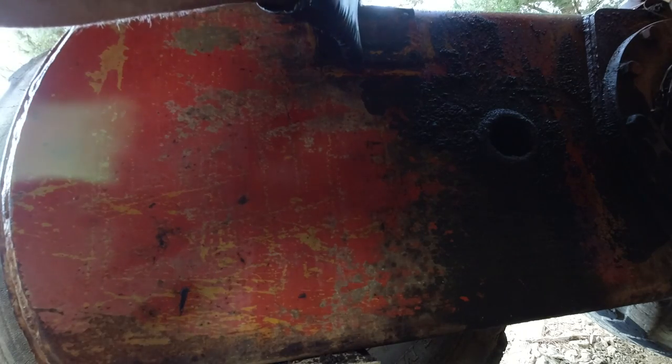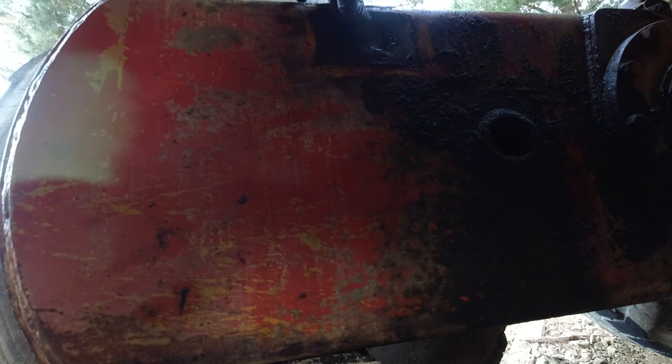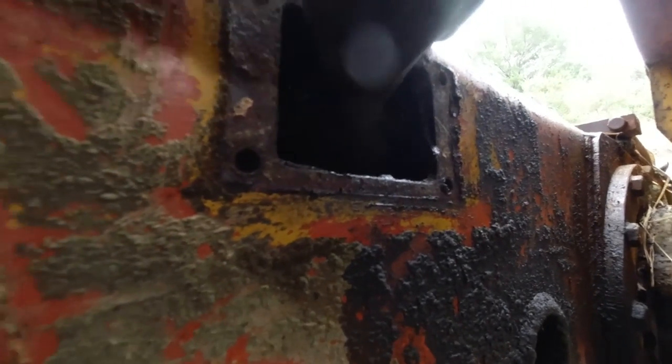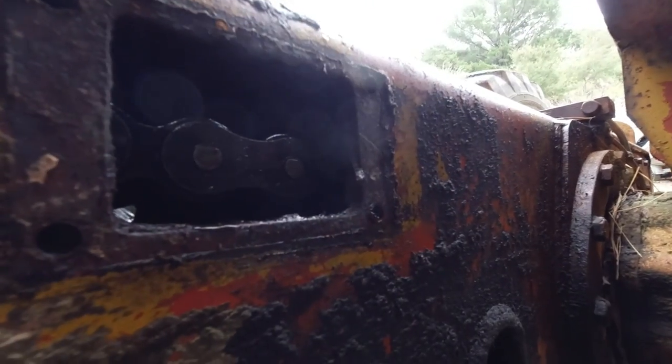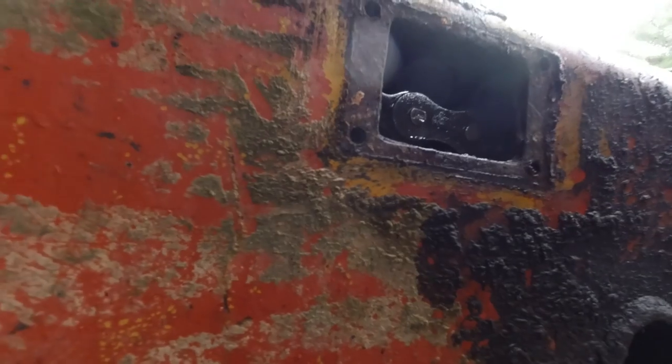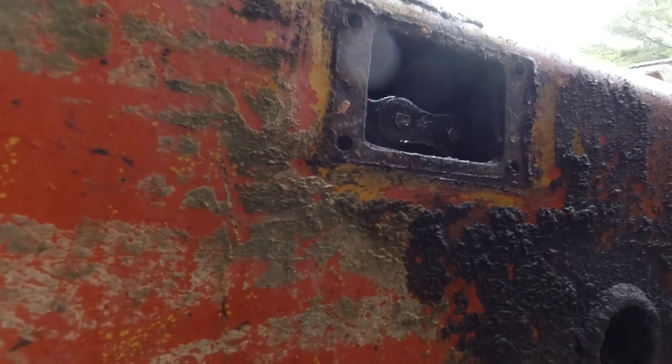And lucky last. That chain feels not too bad. That's about 1.5 inches movement, so that's all the chains at a fairly good tension, I think. So I'll take it for a wee test run and see if that chain stays on the sprocket.